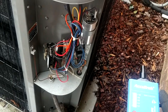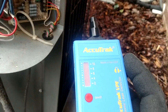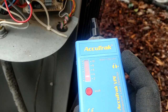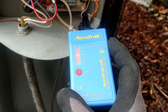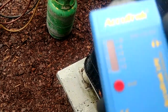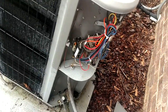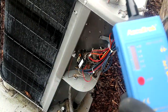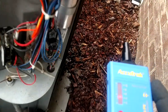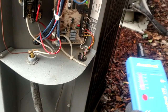Like there was a vacuum running in the living room and you were on the other side of the house and you just kind of heard it in the distance. It sounds like that, and watch how loud this gets. Because this is not just good for picking up leaks — your refrigerant, your gas, something blowing air and turbulence through a hole or a crack or an orifice. It also picks up electrical disturbances, so you can diagnose electrical problems, breaker boxes and stuff like that. I'm getting this noise and it's over on this board and I can actually pinpoint it if you watch this.